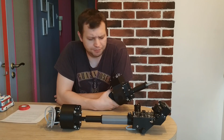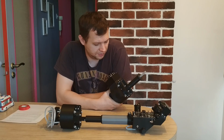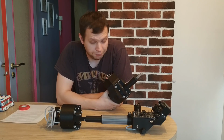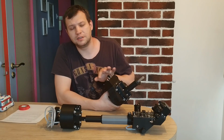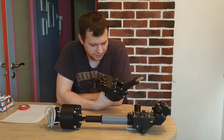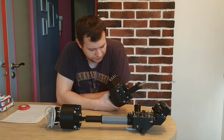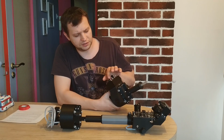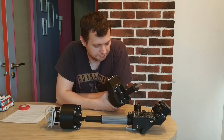So by trial and error, I found that 2 speeds are actually the best option, rather than either analog or 3 speeds per length of this stick, because the stick is fairly, I should say, not the very sensitive and very precise thing, as you can expect from a gamepad stick. So basically you use it as a semi-digital thing, but it works great. You can trust me on that.